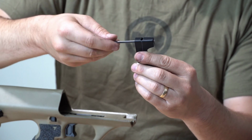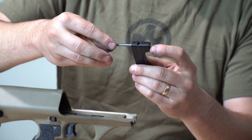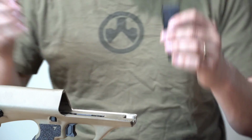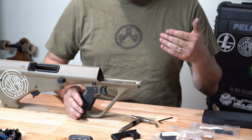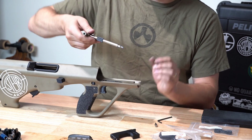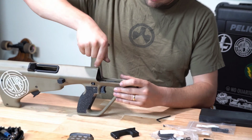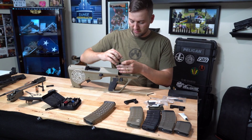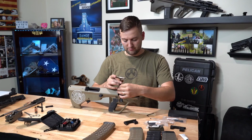So what we want is the metal housing of that screw to be flush with the bottom edge, so only the ball bearing is poking out the bottom edge. That's how it was designed in CAD, and it works pretty good for an initial adjustment. So what we want to do is loosen this guy, so we'll do that real quick. Loosen the primary nut. Get the correct drive here, number 3. All right, backed out. It's loosened. We actually have to take it all the way out because we need to retract the trigger linkage about 1.5 inches.